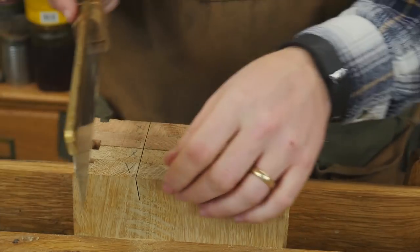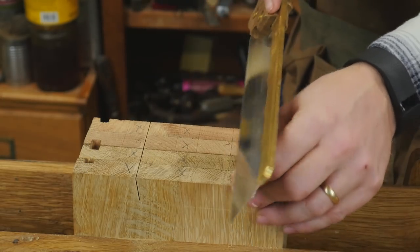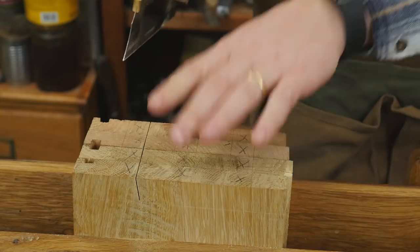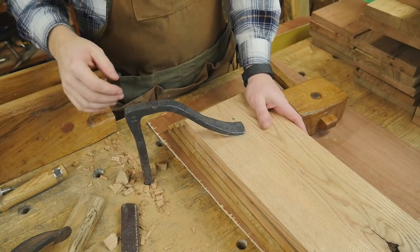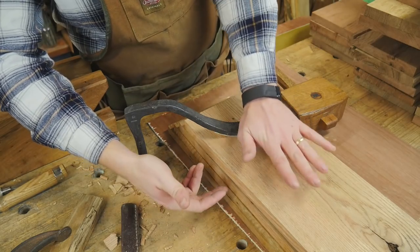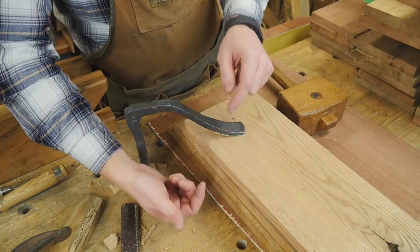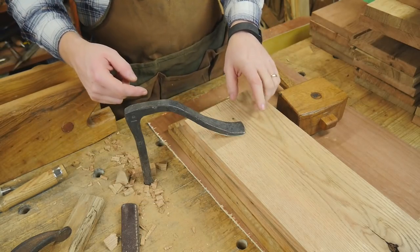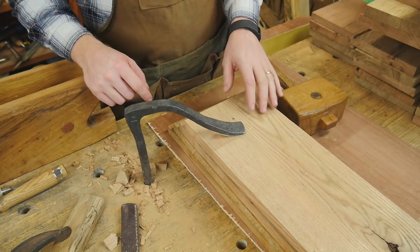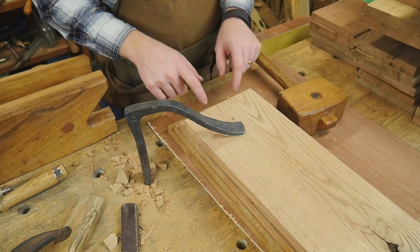Same as the first — I'm going to cut out all of these at that angle. I'll do all of them on this side with this angle, then rotate and do all of them on the other side and finish out these pins. Now what I've done is stacked them up so that all of the faces are up. I want the faces up so that when I cut from the other side, if I accidentally go through, I ding the inside of one and not the face of the drawer. It's pretty rare once you get used to it, but I like to start with faces up just in case. I stack them all in a stair-step manner so that I can reach all of the dovetails.